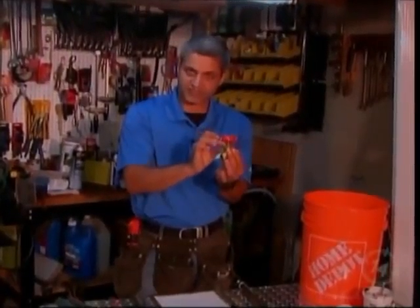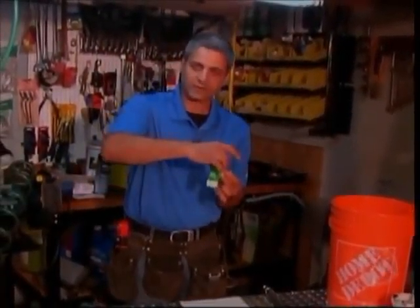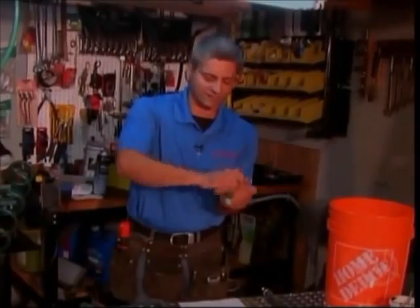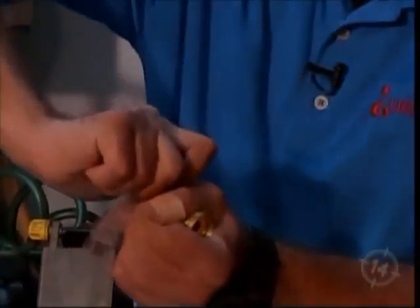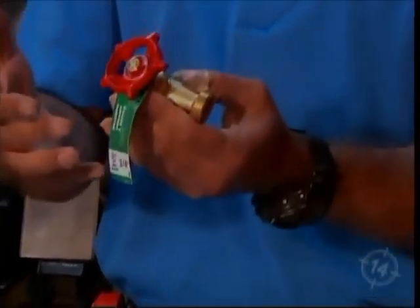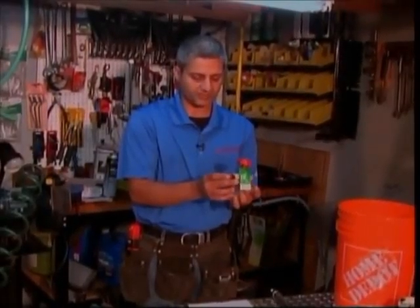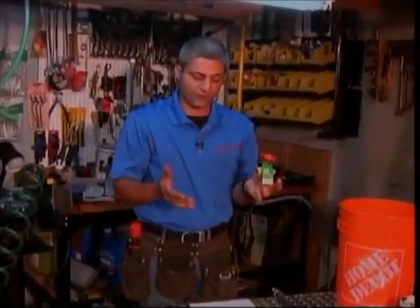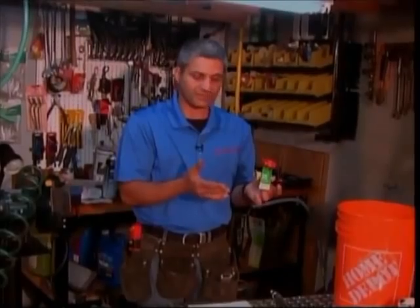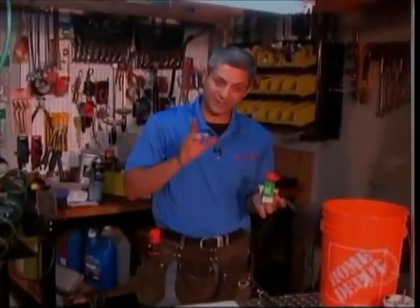There's a rubber seal inside, so the problem is whether it's this valve or, let's say, your bathtub faucet, if it's an original faucet, or your kitchen faucet, the old ones, that rubber seal can be over tightened. So anytime you turn it off and you can still feel some turning movement, the rubber's wearing itself out. So, you're not supposed to overturn these. These are the original system. They don't make sense anymore, although mind you, a lot of homeowners are buying them, a lot of contractors are buying them for one single reason, because they're cheap, not because they're efficient.